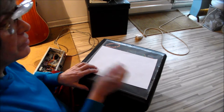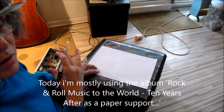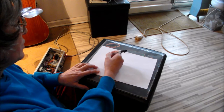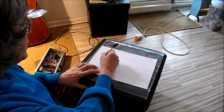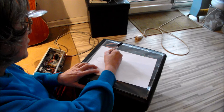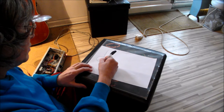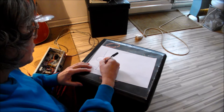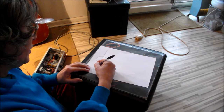I've done a little bit of reverse engineering on the amplifier schematic, on the amplifier itself, by looking at the components. Also, I've looked at a website. As I explained earlier, when you turn the volume down, the noise stops. The reason is that the first stage, if I could draw a valve like that, would be half of an ECC83. That would be the cathode. It goes to a resistor down to ground, and there's a capacitor across there, which is referred to as a bypass capacitor, I think.